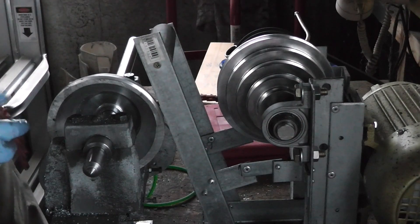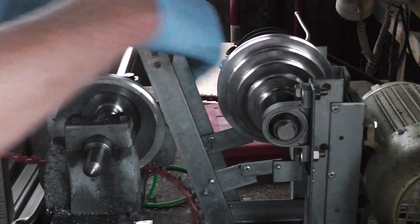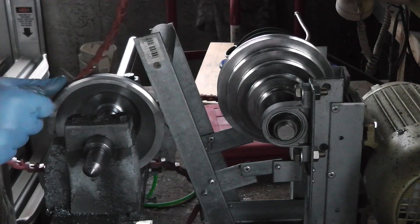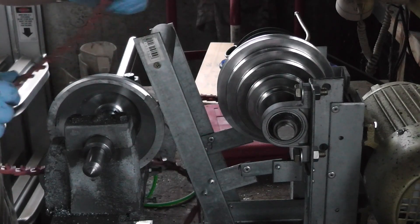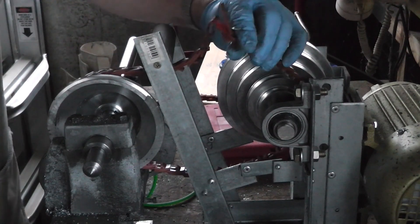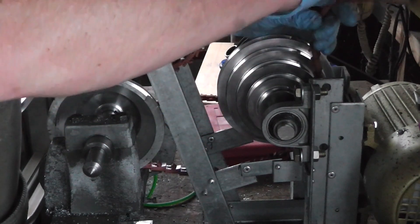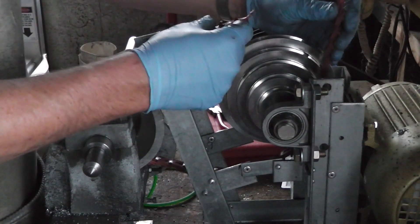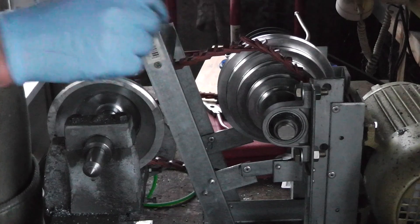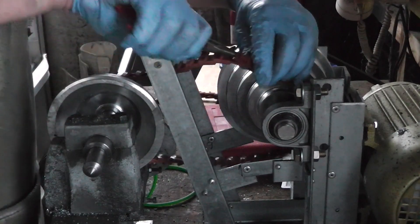I have been told that there is a direction for this. When it goes over the pulley, you want these tabs on the bottom to be trailing, so that they walk into it rather than being forced into it like if it was going the other way. I think I will take a link off — perhaps even two links. I was told the way to put them in is to flip the belt around and work at it from that direction, and once the belt is a loop, flick it back around.